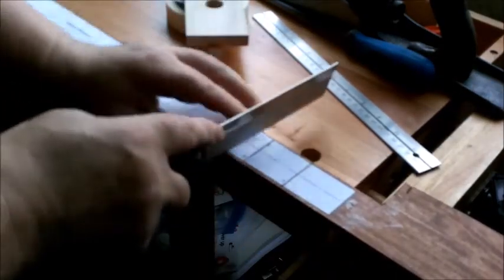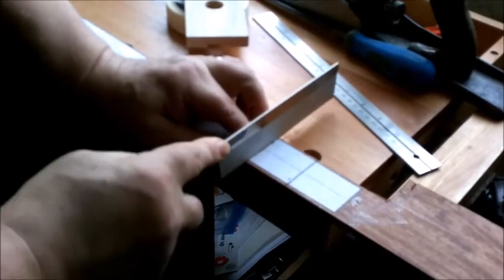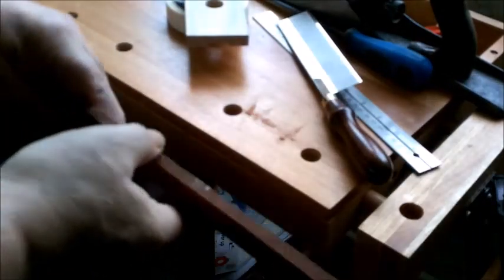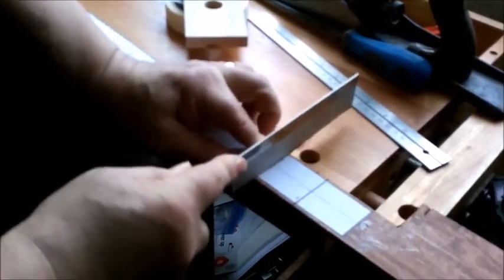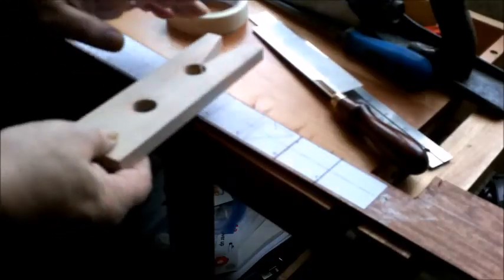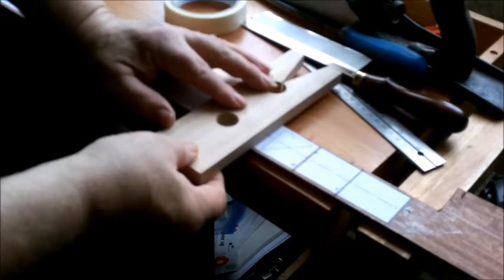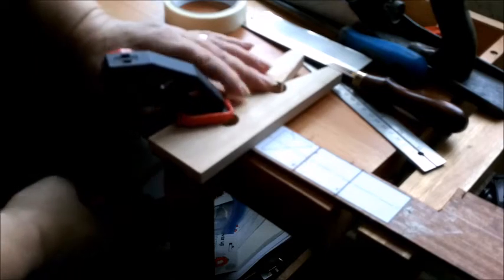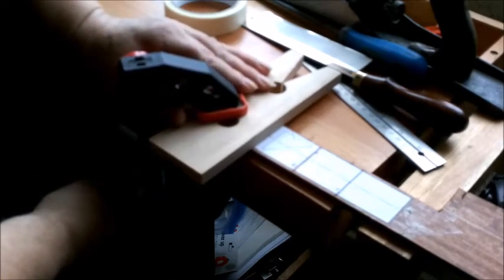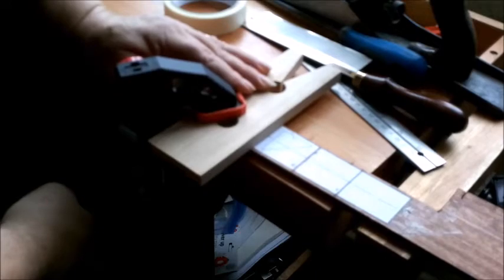And it is now, see, it was a bit of a slight adjustment, which just takes a couple of little pulls through, because these saws cut on the pull back, not on the push forward. I don't know if that's a thing with Japanese saws or it's just for these kinds of things, but it works better. Now I'm just going to show you one more, where this is me clamping that into place, and time spent here is essential. Can't rush this.